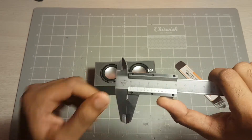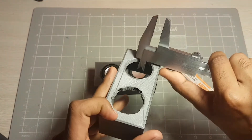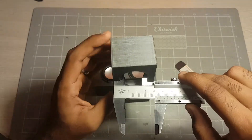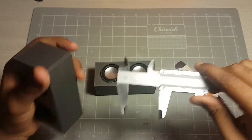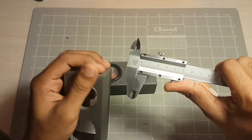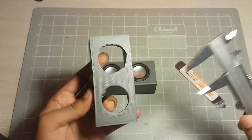I made a big mistake when measuring. Instead of measuring from where the zero is, I measured from where the metal ends. So when I measured the hole, the measurement came out as 3.1 instead of the correct 3.4. When I measured it on the actual speaker, I was looking at the wrong reference point. So a tip: when using calipers, make sure to align the zero with whatever you're measuring, just to prevent spending a few hours on failed prints or prints that don't come out to the right size.